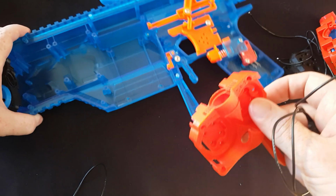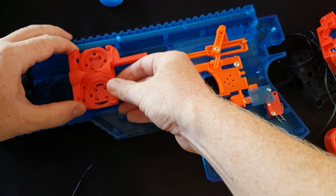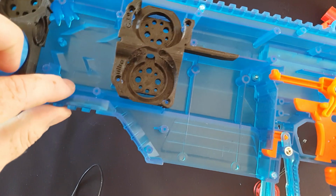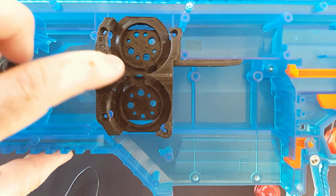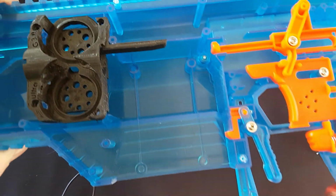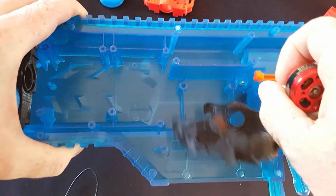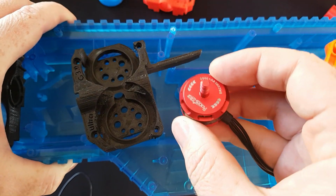But when we put that in a Swordfish Stryfe, what is this thing, Dominator, we've always had this problem that of course that doesn't fit in there, that you have this line running here and here on the Dominator, which meant you had to cut the cage to fit them, which was okay, but because of the size of the base on this, it limited how far down the motor could sit, because the side of the motor needed to clear over the top of this, which meant the motor had to sit relatively high up.